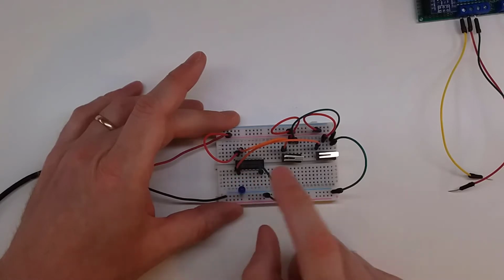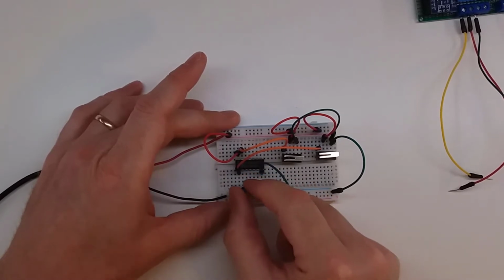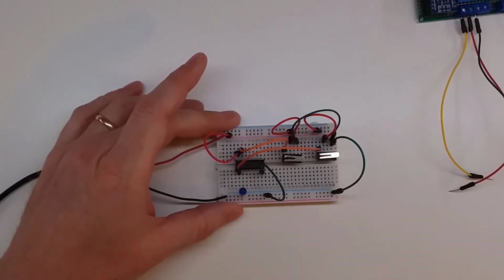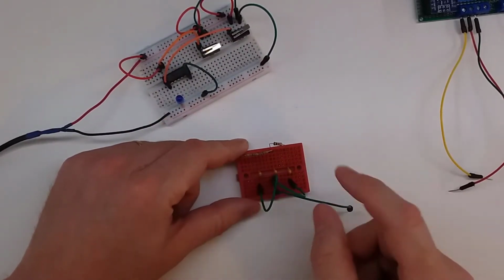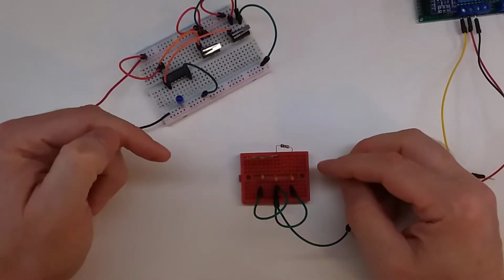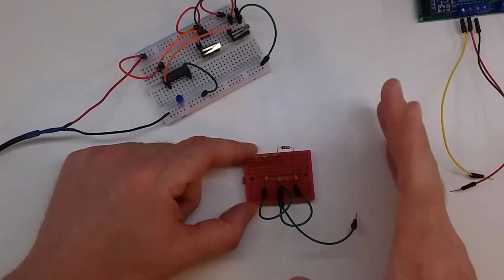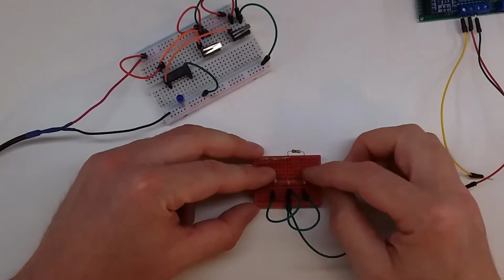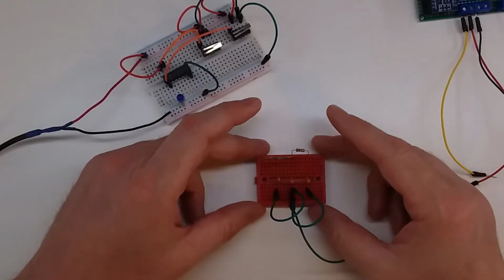What we're going to do is feed in a signal on the input, and we'll see how well the output tracks. But because this is also analog, we can feed in a sine wave or some type of audio wave and then turn this on and off. In order to do that, I built up this little tiny circuit real quick. All it is is a couple of 10 nanofarad capacitors and a couple of 1K resistors. So if I feed in my square wave here, I'll get a kind of sine wave out here on the right. Now it's not awesome, but I don't actually have a signal generator, so this is the closest that we're going to get. But we'll be able to also feed that sine wave in as an input and see it work from an analog standpoint as well. So it's bound to be kind of interesting.